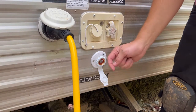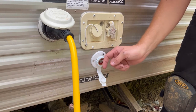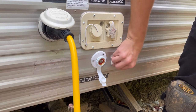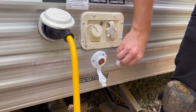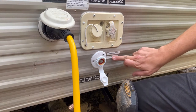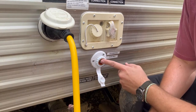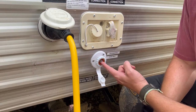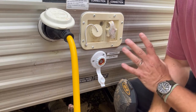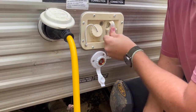The water will drip right out through the port, so I'll add something to direct it slightly away from the camper wall. I'm putting a label right here that states this is for the dehumidifier drain only. That's important because if you're going to sell the camper or someone borrows it, hooking up pressurized city water to this port would be a bad idea — I've removed the check valves, so it would just blast water inside the camper. City water of course connects to its own labeled port right next to it.